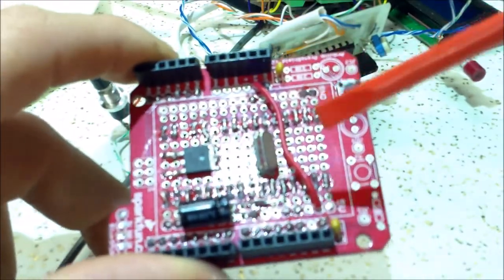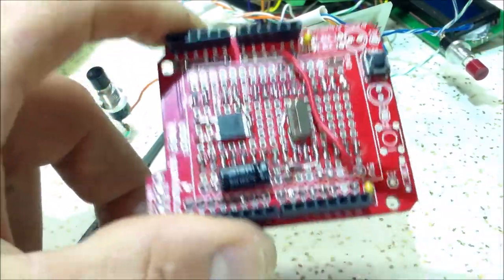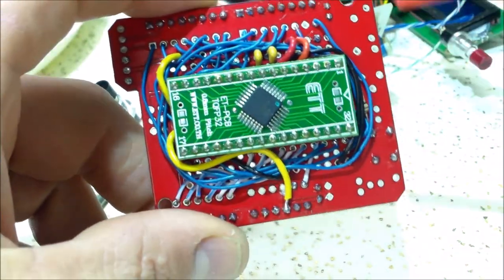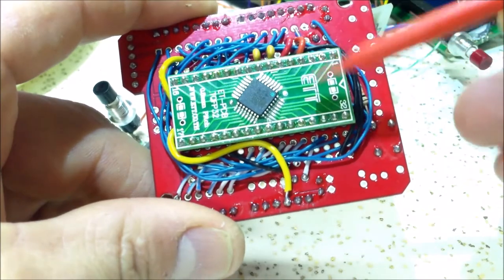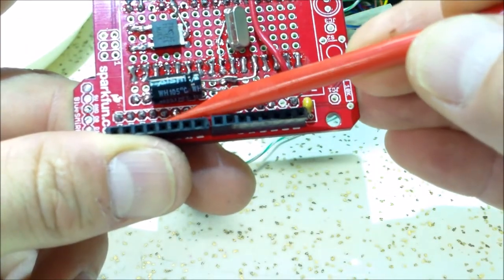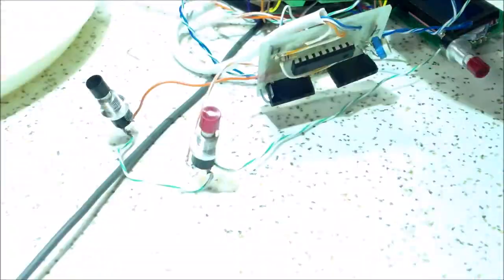I was editing the video for the Typhoon LED controller specifically for the Arctic T247 and wanted to reiterate some unique things I did. This is an ATmega328p in a TQFP package soldered to a little adapter board with a SparkFun shield — I essentially made my own Arduino. The reason that's important is there are only a couple of PWM pins on this board, and two of those are pins five and six. So instead of soldering digital pin D5 to the D5 spot, I actually soldered it to the D2 spot — that essentially makes my D2 header location a PWM pin. In the sketch you still call it D5.